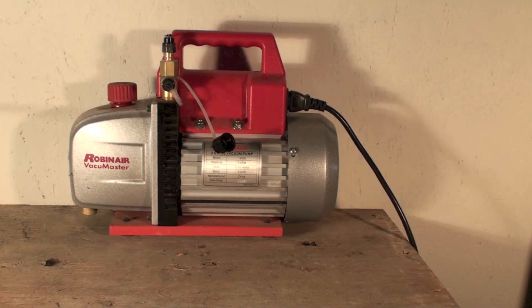The vacuum pump. Why do we use vacuum pumps in refrigeration systems? Early on, we did not use vacuum pumps. What we did is if a system was broken open, the refrigerant was taken out and the atmosphere was in there. That means moisture and assorted other non-condensable gases were in the system.